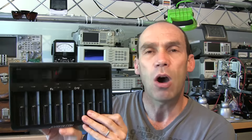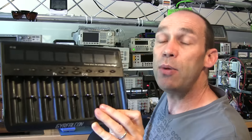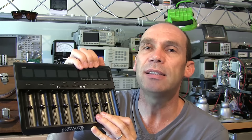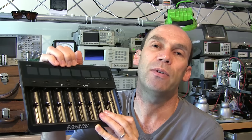I'm going to demonstrate how it works. There are a few quirks with this - it's a manually operated device compared to the other charger I previously reviewed where you could put a cell in and it would almost automatically start. This one you set up manually, which I don't think is a bad thing. You manually set the voltage and the current that you want to charge at, and then you hit the button for it to start.